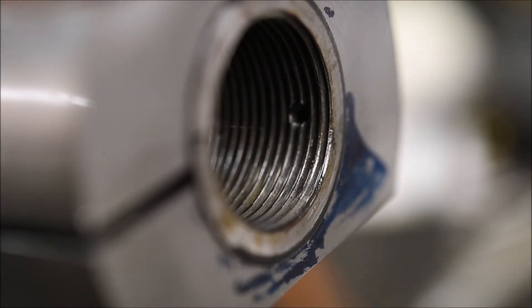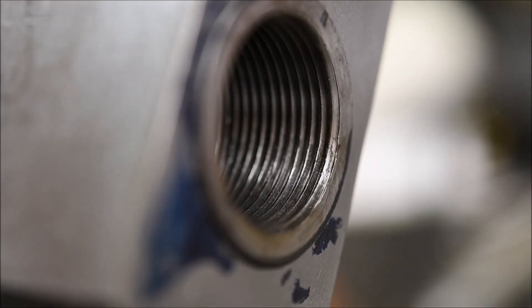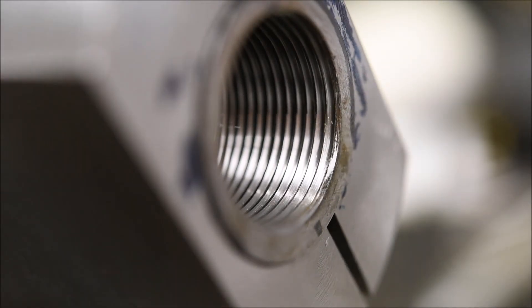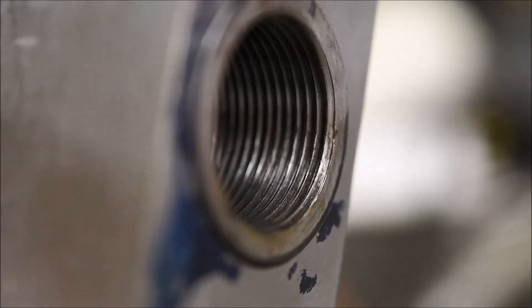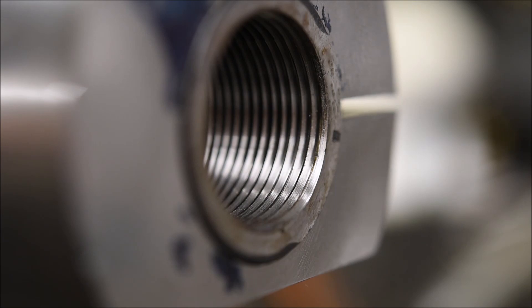The face of the receiver is also re-cut. You simply slide it on a mandrel, lock it in, put it between centers, run it on the machine, and take a facing cut off the face. But facing is irrelevant if you don't get the threads close. Another thing a lot of people don't consider is that the threads on your barrel and the threads on your receiver have to be a dead close fit — almost a class four — to keep the barrel lined up. If you've got any wobble in your threads, if you screw the receiver on to the point where it still has a lot of click when you try to twist the two together, the threads aren't going to line up properly, it's not going to be square, it's going to cock off to one side every time. You can't rely on the shoulder to square it up because it won't — the threads will sit cockeyed, and you won't get true runout when you try to run the barrel and the receiver together. It will always be way off, usually 15-20 thousandths of an inch at 10 inches from the receiver face.